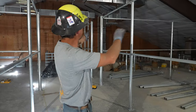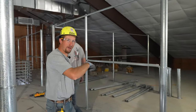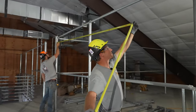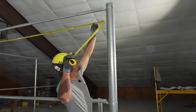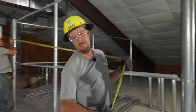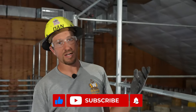We're gonna go ahead and take a measurement for this section right here. We are going to cut our chain link down on the ground, and then we're gonna bring the section that we're cutting up so that we don't have to pack a full roll of chain link up here. We have 161, and we're gonna go ahead and take 4 inches off that. Hopefully we're taking enough off to the point where we can still make the fabric tight, but if we need to take any more off, we can pull another individual strand out up here.